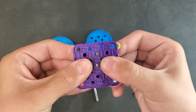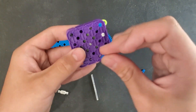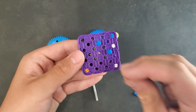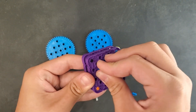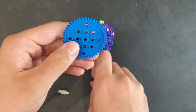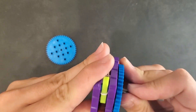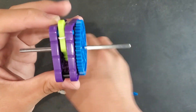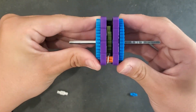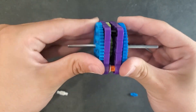Put the next 4x4 plate on. Then use your 4 pins and form a plus sign around the hole where the shaft goes through. Once that's done, put a cap shaft through a 48 tooth gear and attach that to the ratchet mechanism. Then put the other 48 tooth gear on the other end of the shaft. Do a few tests by spinning one of the 48 tooth gears and testing the resistance one way versus the other. If it only spins in one direction while providing resistance, then you know it works.